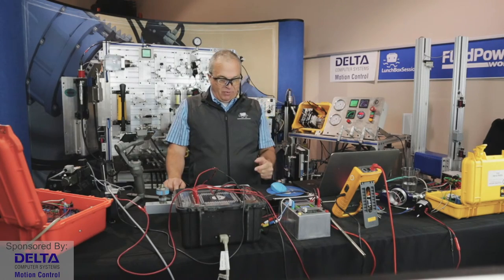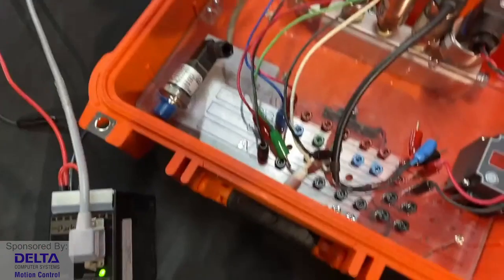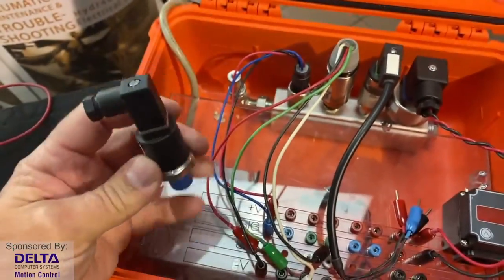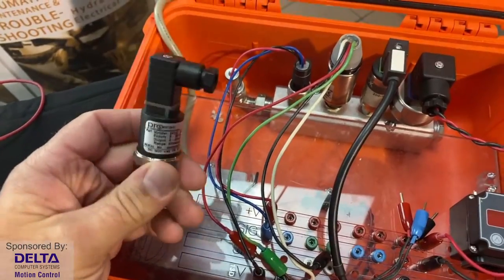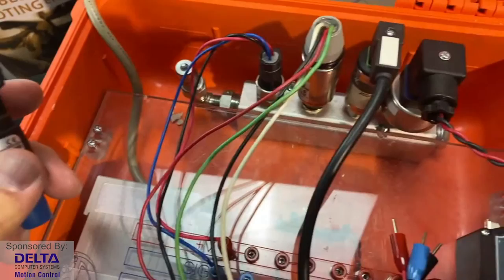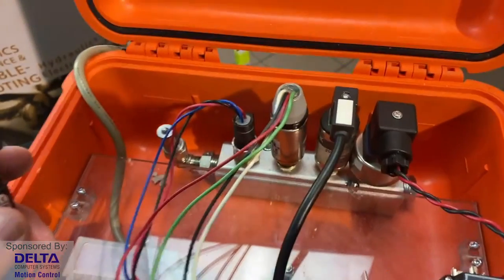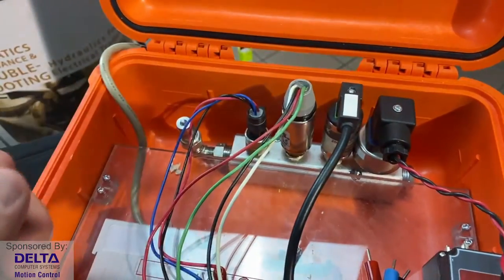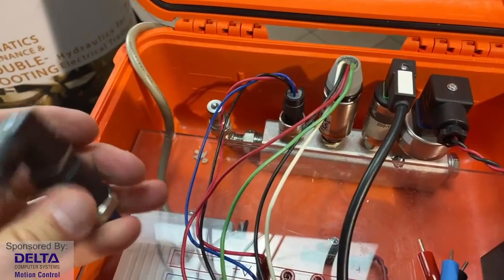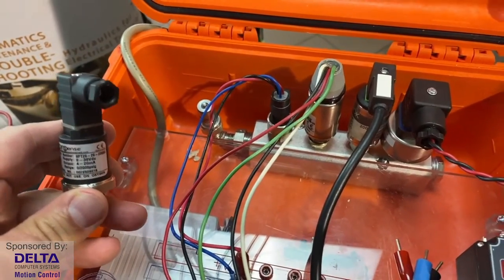All right, pressure, hydraulic pressure. Probably everybody's been waiting to think about that one. Pressure transmitters usually come in little cylindrical shaped devices that just thread directly in. Here you can see a manifold with four different pressure transmitters. These are not pressure switches, right? Pressure switches you adjust with a screwdriver to some pressure value and then click.